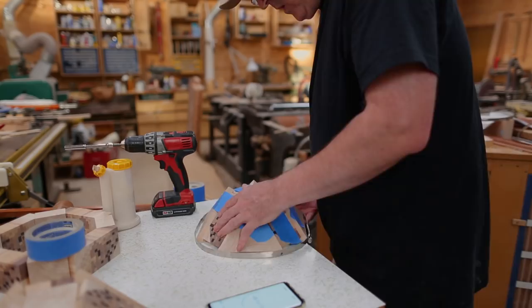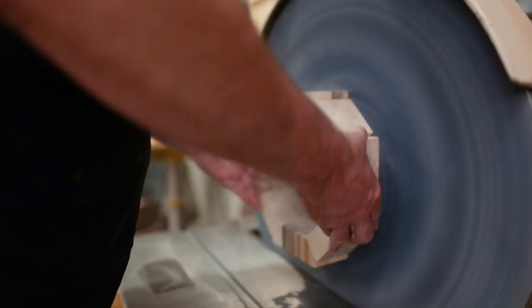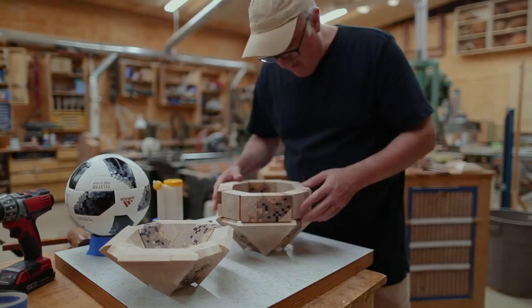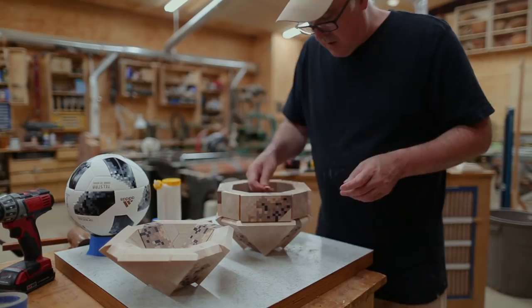In doing it this way, I could check the inside and make sure the joints were tight. Once these were set up, I could sand the surface of each of these halves that will meet up with the first ring that I glued up. This is the final glue-up — again, it's just two flat surfaces being glued together, so I can keep it nice and tight. It's really just a matter of keeping it aligned. Now if my geometry is right, hopefully there's a sphere inside of this. I could just clamp it with two rings.